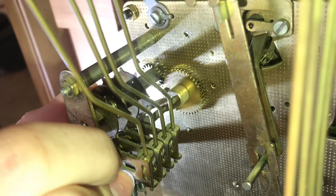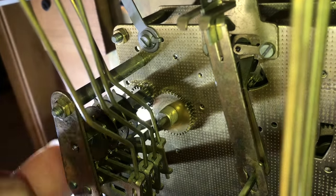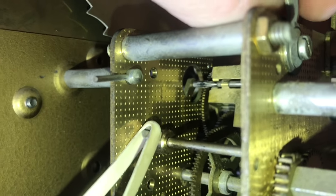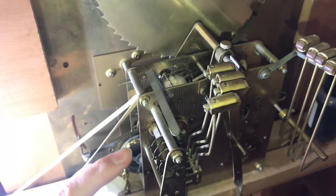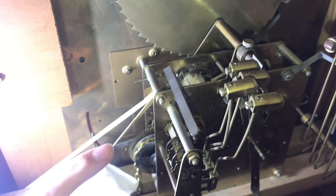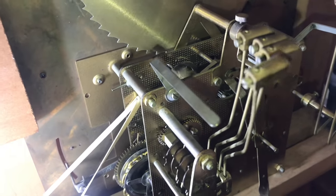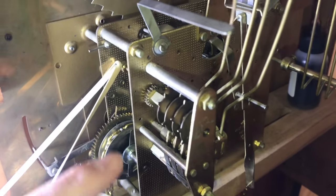It's starting to feel a little better — I can definitely feel it. It's starting to move longer once I let go; it just wants to keep going. Getting the back side of these axles is pretty difficult. It's actually starting to go by itself. I just put one drop of oil on the edge of this flywheel, and as soon as I put the oil on, I could see it starting to move and then it started going. That's all I had to do, and I'll keep oiling the other spots.